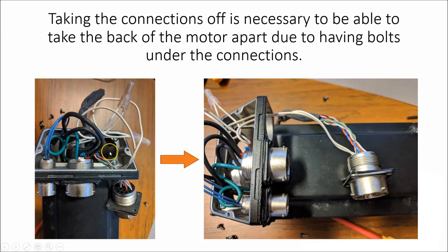With the top section taken out, you can see the cable connection connects here and then jumps down to the actual encoder plug. I've taken the plug loose so you can see it. You have to take the encoder plug loose because there are bolts right here — you have to take the brake side and the encoder plug off to get to this bolt to be able to take the top housing off. There's a screw here and four screws holding this in.